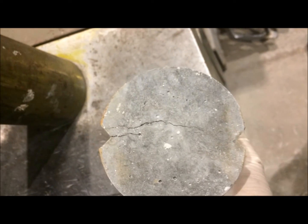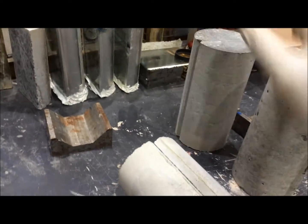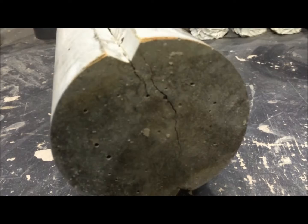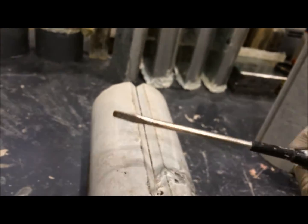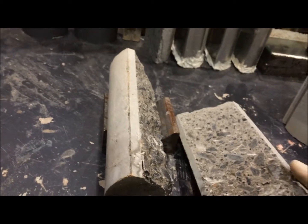That's how we do splitting tests with these concrete specimens. Sometimes you don't have that V-notch and you just have to use another completely round specimen. So here I have the specimens that have just been split in the compressive strength testing machine. I'll put them here. These are the cracks that go through until this side. So normally what I do, I just get this minus screwdriver, place it here, and just keep going — simply like that — and I can put it down and have my split specimen.